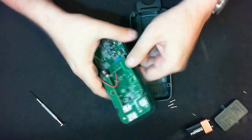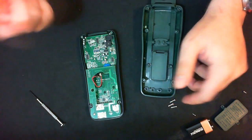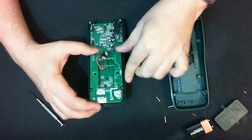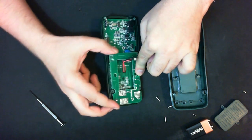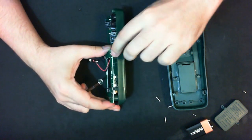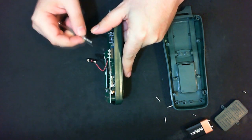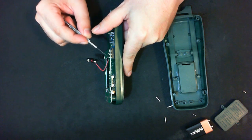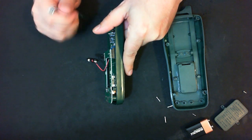As you can see it has a U-channel so it is not too deep. It has no rubber in it but it will do. Unfortunately there are still no fuses at sight. Inside we see dual board construction. The upper board goes into a 0.1 inch header, and there is one more female pin than male — we have six male pins and seven female sockets, so maybe those extra pins are used in some other multimeter model.